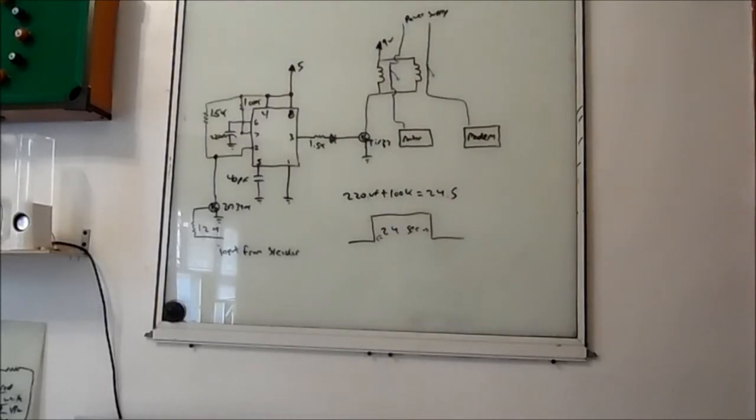I'm using two power supplies: I have a 5-volt supply for the 555 timer, and the relays I have operate on 9 volts. I tried hooking the 555 timer to the 9-volt supply but it got way too hot, so I decided to use two different power supplies with their grounds tied together. Someone will also ask why I didn't use transistors to turn off the router and modem instead of relays — I tried that, but the transistors got way too hot and would have failed. I went with relays, and I'm using normally closed relays so the power supply is connected at all times until the 555 timer monostable is triggered.